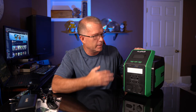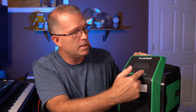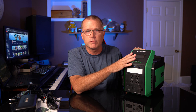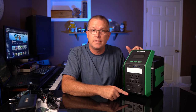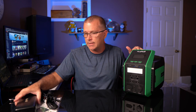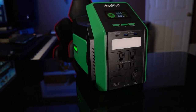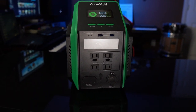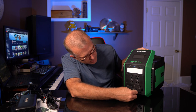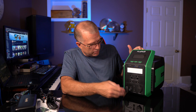After giving this a quick once-over, the power buttons are on the top — you activate the DC and USB ports here, the AC inverter in the middle, and the main power right over here. This is a pure sine wave inverter with an MPPT charge controller, and the DC input max is 200 watts. There are four AC ports — two three-prong and two two-prong — plus a 12-volt accessory port and a couple of DC 5521 ports. The charging input for AC or solar is on the back.